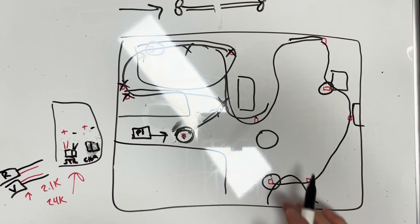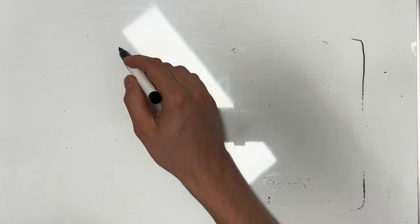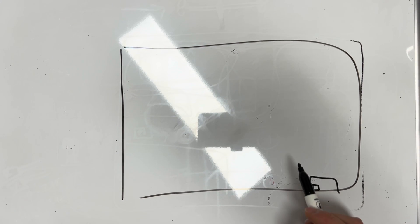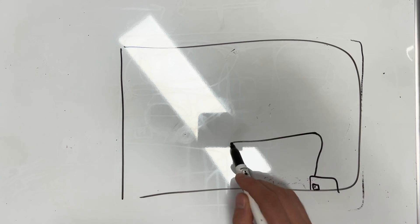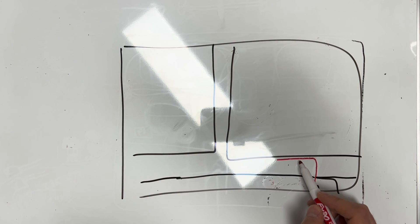We did the same thing upstairs — not with devices in boxes but tracing the wire itself. On the third floor there was another panel in a closet. By tracing the wire through the riser box, we set up the toner in the basement, went up to the third floor riser, and found the signal. We took the toner wand and confirmed the wire was coming up through there, then checked through the ceiling — the wire was going down the hallway next to the closet.